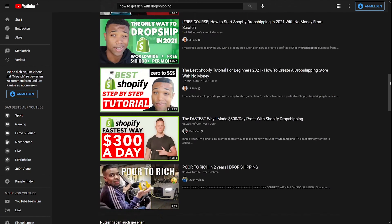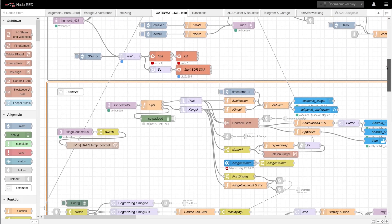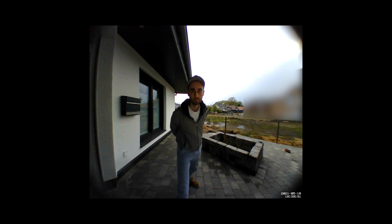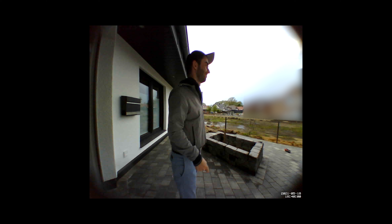Via a relay, the touch sensor can also trigger a chime if you have appropriate cables in the wall. You can also transmit the ring signal via WiFi and MQTT to Home Assistant and let your phones ring. The image is transmitted via WiFi anyway. So that I get a photo immediately — like just when someone is ringing the bell — I transmit only a low-resolution image from the moment of touch. 1.3 megapixels is still more than my first camera phone had, but it's enough to recognize who's ringing, and for face recognition it's also enough. You can also record video with MotionEye, but the frame rate is not quite comparable with an action camera.